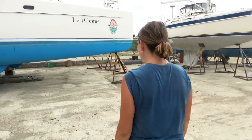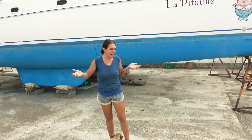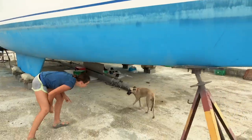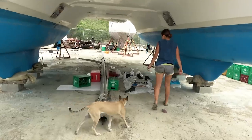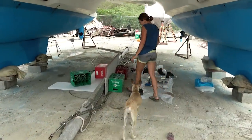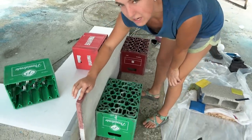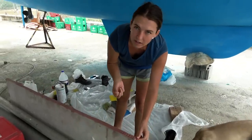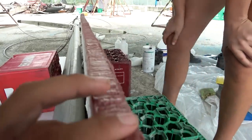Come check out the workshop. These guys took off and left their boat here — it's the best way to stay out of the rain and do some fiberglassing. This is pretty much set. We just did this maybe an hour, hour and a half ago — thickened polyester resin with a fairing compound, trying to seal up the edges of our honeycomb core.